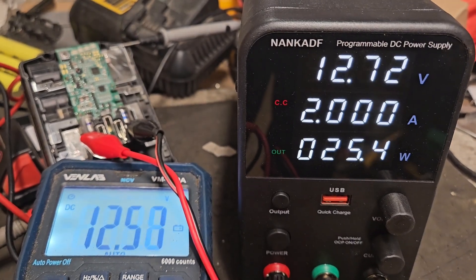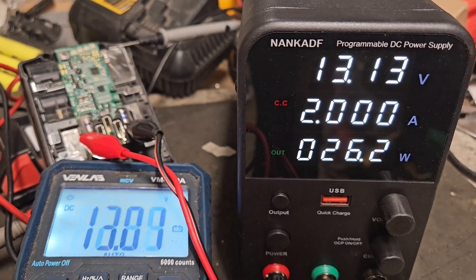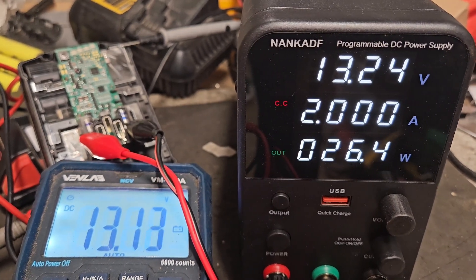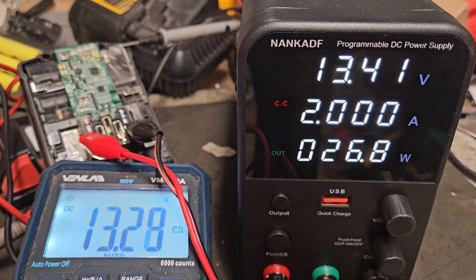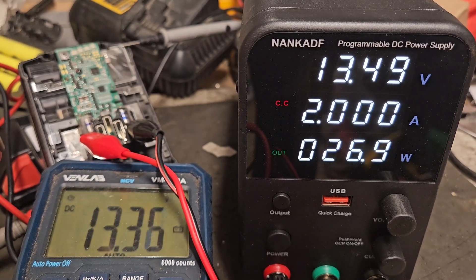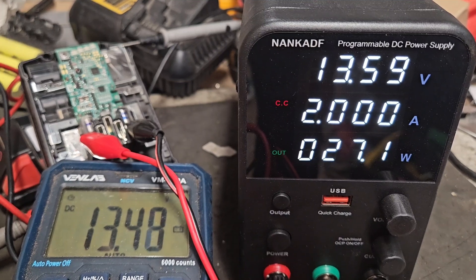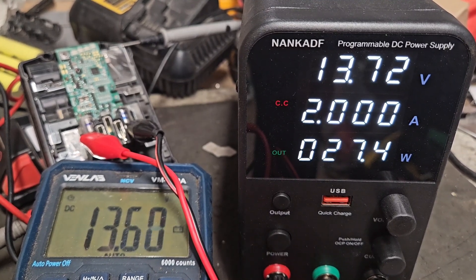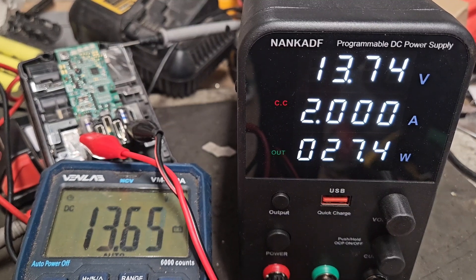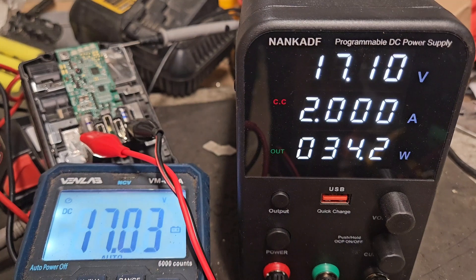See it's going up right away. As soon as that battery reaches 17 volts we're going to get off the charge and stop the charger. It takes longer than the jump start method, but like I say it's much safer. You can see it's coming up to 13.4 — this is not going to take very long at all. I'm going to pause the video and then we'll start up again when I get to 17 volts.